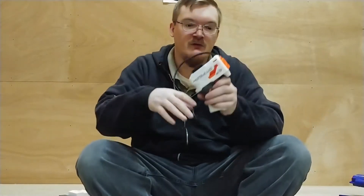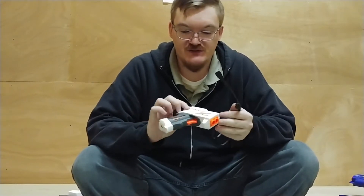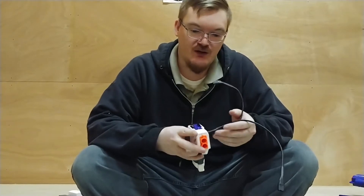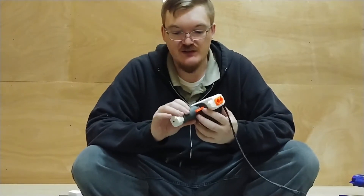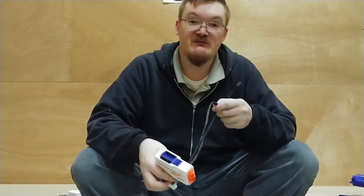Because there is no existing trigger solution that really fits the need, this is what I came up with — a Modulus Grip Blaster attachment, which is now discontinued but you can find them here and there. This has just got the wiring for the battery and the motor going in through the side, down underneath into the grip where it's wired to a standard Omron switch. Probably not as well as I'd like. If I was doing this over again, I'd tell somebody not to put hot glue in a position where it would drain into your switch — not the best idea, but we live and learn.